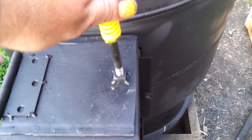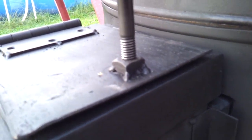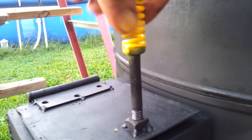I made this top and threw it together this morning. The handle is dual purpose — it gives me a handle and it also threads. I welded in the nut right there, and turning it like an axle gives me an air adjustment. You can see the flames pick up. I found that it works best once everything's up to temperature with this thing throttled all the way back.